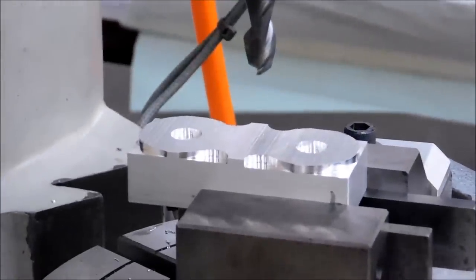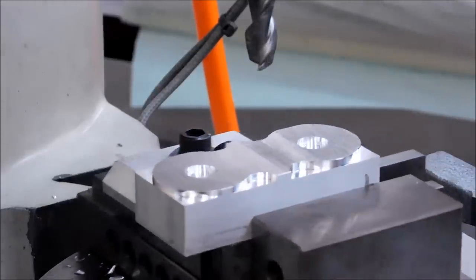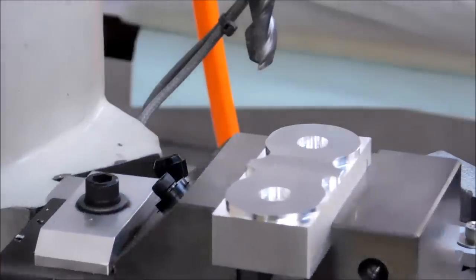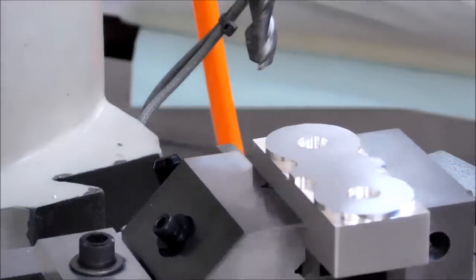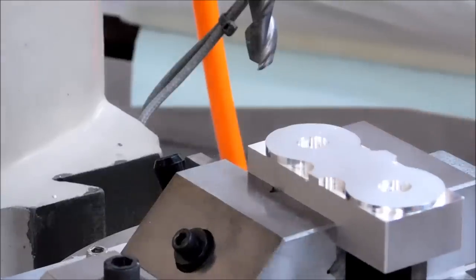Both ends of the link cut are complete. This is when we re-register the table and the rotary table true to the same crank movements. Returning the stopper rail to the rear where we started. And I'm going to eyeball this, guys. I do not have the step coordinates to the centers of these, only because I wanted to do this really quick.